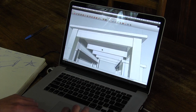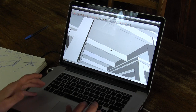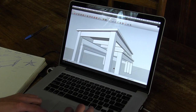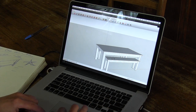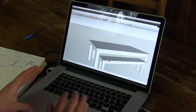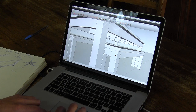On the underside, I've just roughed in a few reinforcements. This isn't the final dimension of the reinforcements, but it gives me an idea of what I'm going to require for construction. When we move on to the bench seats, you can see it's pretty much the same design, except it's scaled down and obviously a lot narrower. The top has been kept at 30 millimetres thick — we want the table and the bench to match in that respect. But the legs have been scaled down to 75 by 75 millimetre stock, and that goes for the rails as well.